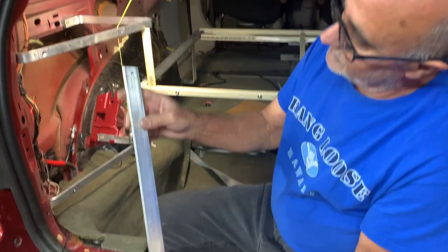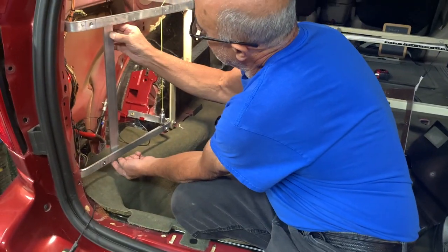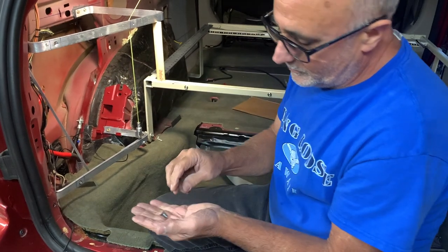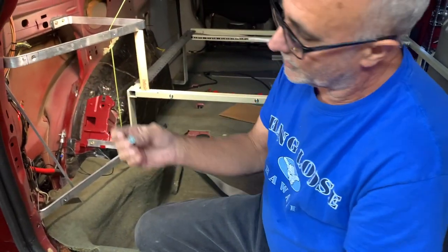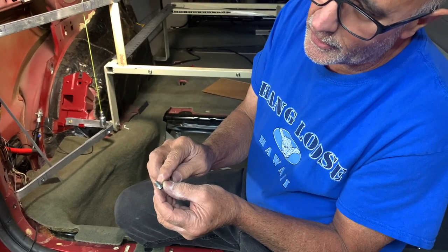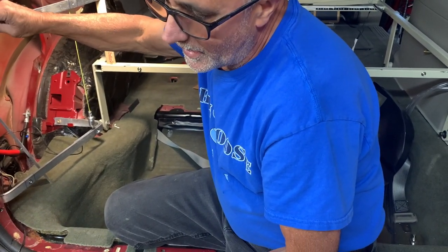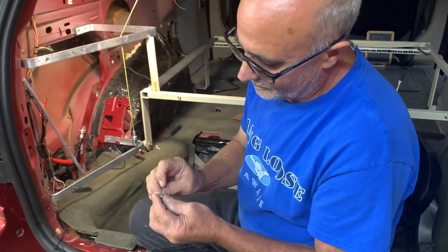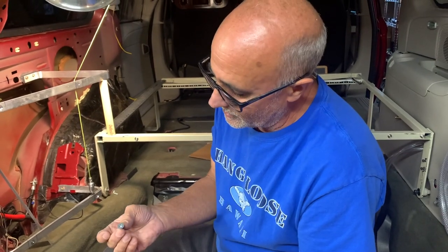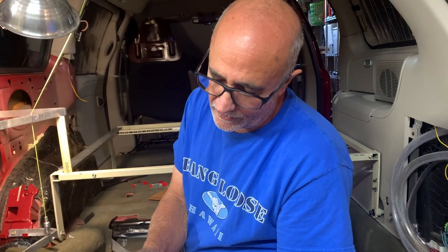I've cut the lengths of the quarter by one-and-a-quarter and I'm just going to do this one final hole. The screw we're using to fasten this is called a flathead screw — the thread is a quarter-twenty. The quarter means it fits in a quarter-inch hole, and the 20 refers to 20 threads per inch. It's a standard American size, and I'm using it because I had these little half-inch flathead quarter-20 screws on hand.